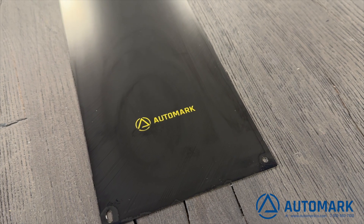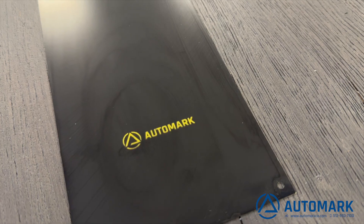The first laser plate we will discuss is our CO2LP plate. This is a lower-priced plate that allows a CO2 laser to be used to etch an image in the plate. It is similar in color to the WS43 plate and lasts about the same life at 15,000 prints. The second laser plate is the COL40 plate, which has a black polymer top and a yellow layer behind it to indicate the appropriate depth. This plate cannot achieve the level of accuracy as other laser plates but some prefer it for the ease of use. It can be used with a fiber or CO2 laser system and lasts about 20,000 prints.